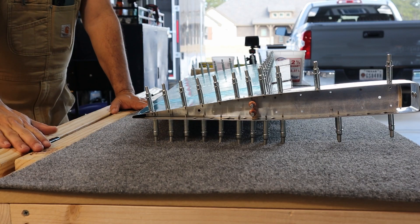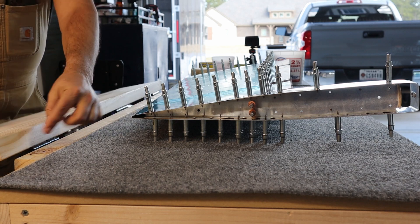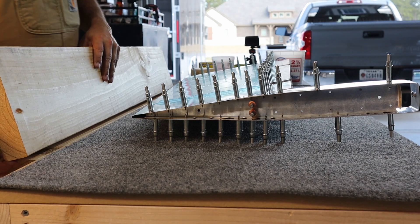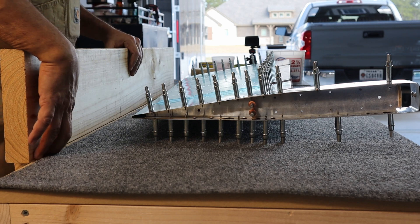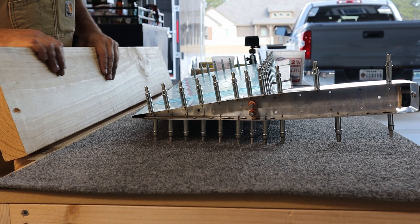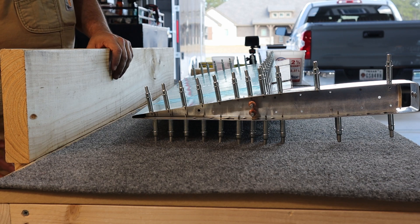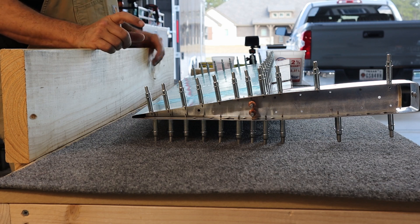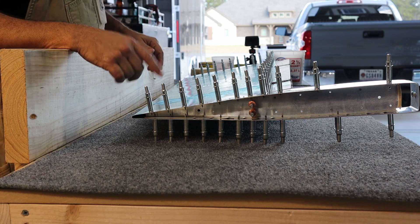I removed the bending brake. I had a gap between the two boards — when they closed it would maintain a gap in there. The gap between the two boards was about a quarter inch when closed all the way. You can go all the way forward but it's hard to get leverage out there. So I basically disassembled it quickly, refastened the hinges so it is flush, cranked on it a bit, and really reduced the amount of space between the skin and the root rib.